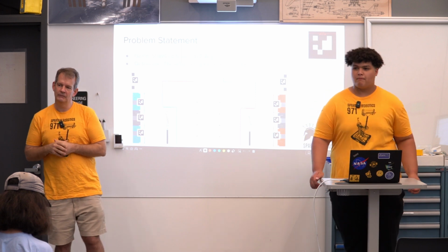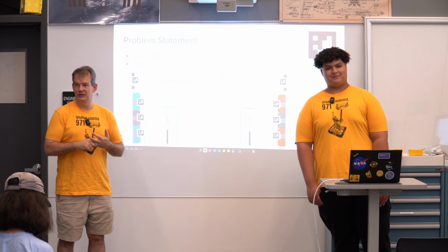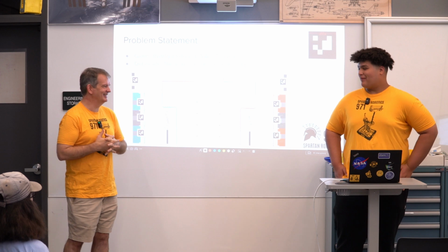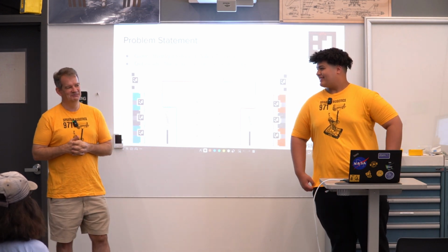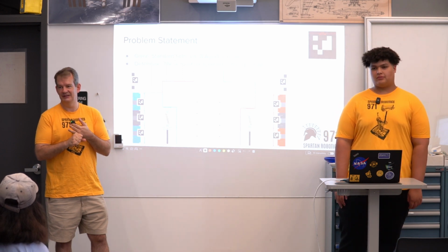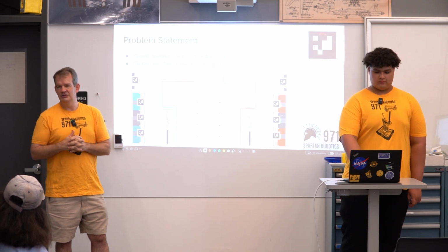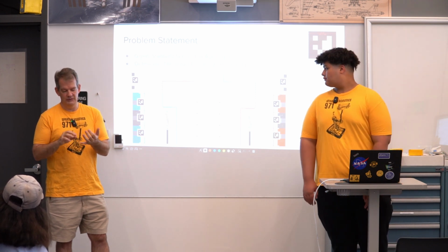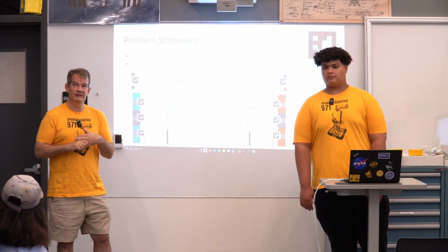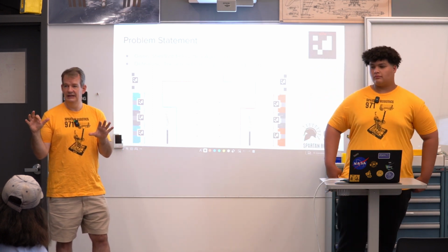How do you figure out which libraries you should use? Question was, how do you figure out which libraries to use? I don't think I'm going to have that much more insight. I think OpenCV has been a library that classically just gets you a lot of bang for the buck. There are so many things contained in that that we've used it. It does great for doing calibration, for estimation. They also have AprilTag detection in those libraries. We've moved to the April Robotics libraries.